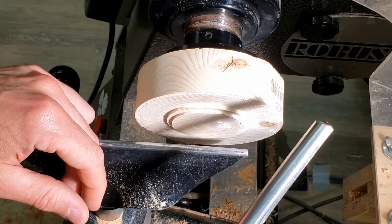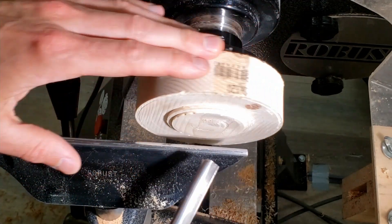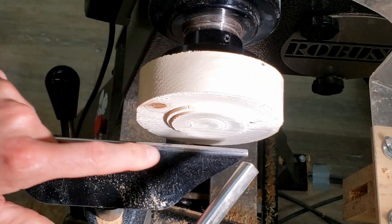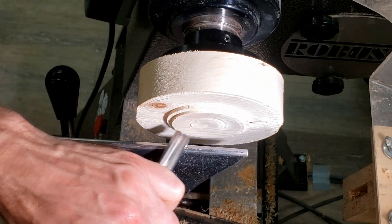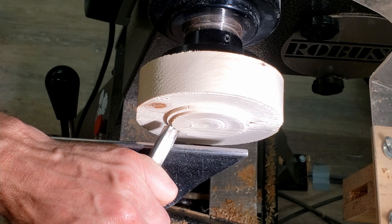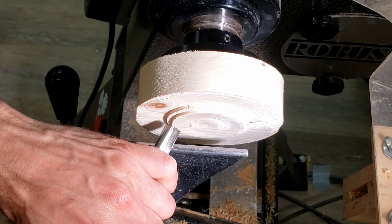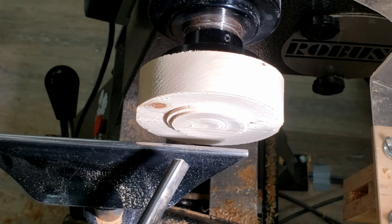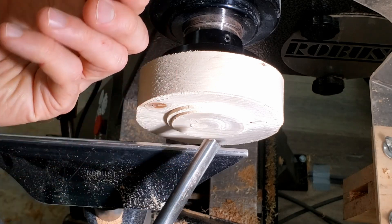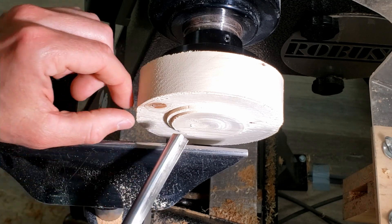Come in with one of these for a higher quality finish — a couple of passes. I've got this piece of pine, and what I'm going to do is first take off these two little domes, and then dish it out pretending as if it's a bowl. Along the way, I'm going to demonstrate how to approach and do an entry cut onto a flat surface. When hollowing a bowl, entry cuts are a big thing when coming in from the rim, and you might find yourself wanting to do an entry cut with the bottom feeder, cutting onto a surface and leaving a nice sharp corner.